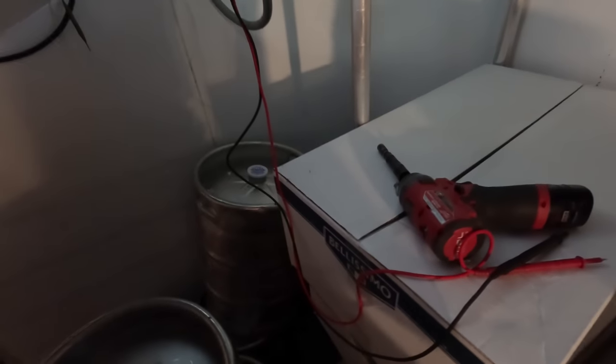So that also explains why the TXVs are so noisy, because we're low on refrigerant. Just about guarantee it. So let's just go outside and do that real quick, because we'll probably have to look for a leak in here. All right, what we're gonna do is grab the leak detector. Might as well go in there and check for leaks before we get the fan running. That way it isn't blowing the stuff all over the place.